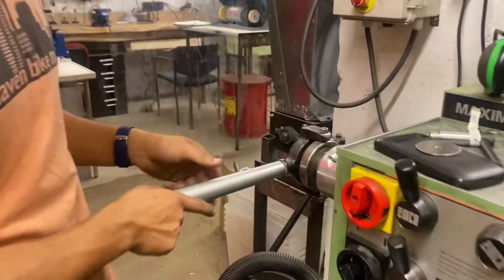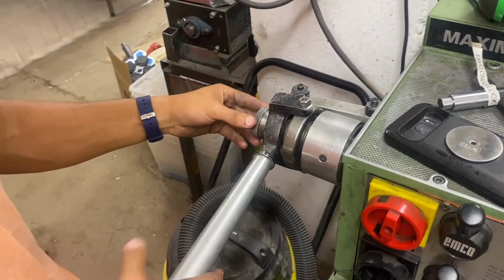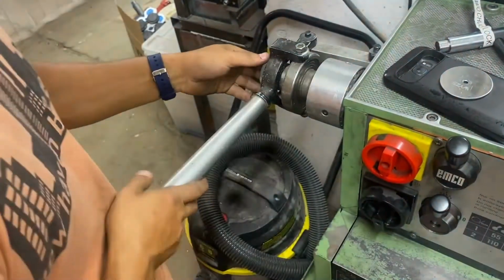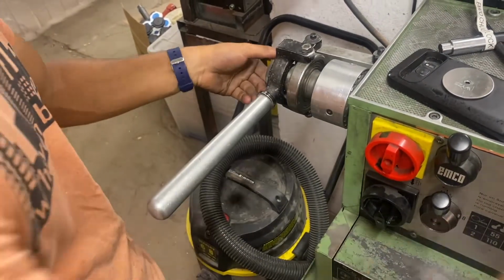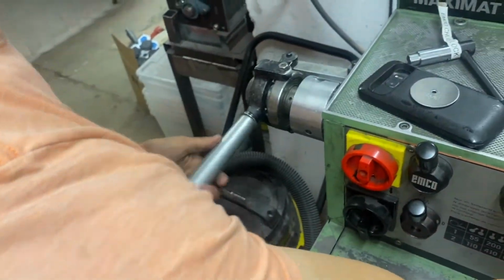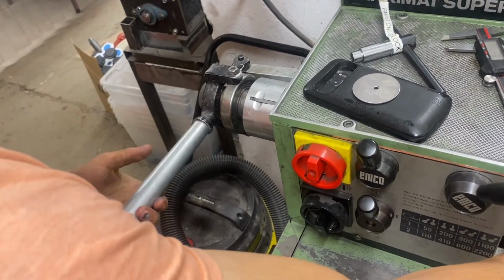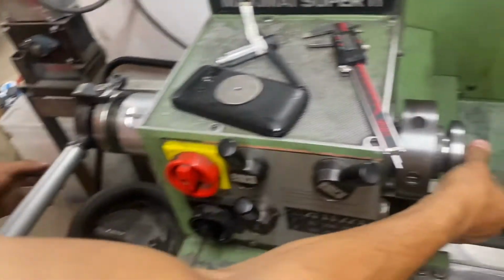So I'm just gonna repeat that just so you can make sure to hear that. So over here, it was too tight, you can't pull on it. And then over here, it's too loose, that's not clamping anything. And we're gonna tighten a little more, too loose, too tight, back off a little bit, just there. Now that piece is really nicely in there.